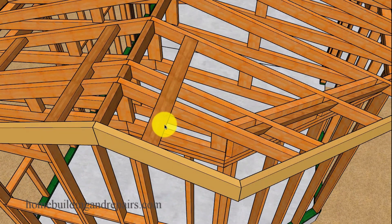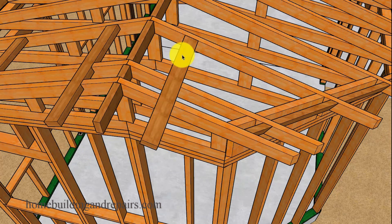I moved this over a little bit because this piece of fascia board is going to have enough structural support from these trusses and the overhang to support this area. However, you could always add an additional lookout somewhere down here if needed. Keep in mind we're not getting any support here from the ridge, so we'll need supports closer to the ridge. If this were a conventionally framed roof, the ridge would come all the way out and we might not even need this board. Something to think about when designing your project.